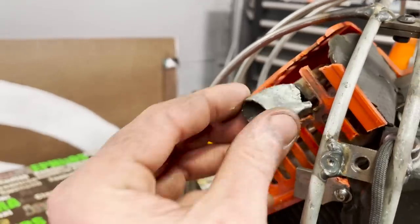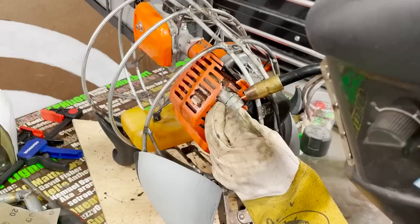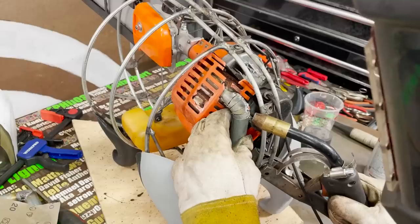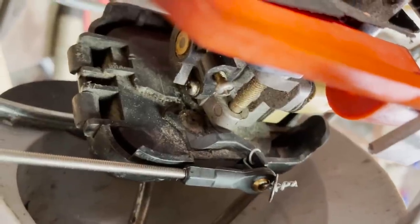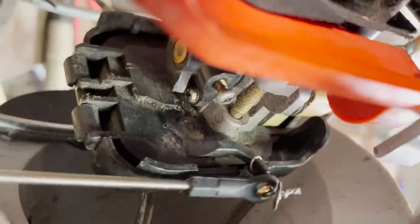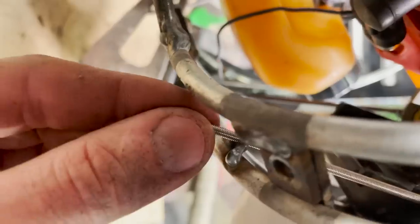With the engine in this position, the exhaust is basically going to melt a hole through what would be his left butt cheek. So I lobster backed a pipe together that reroutes the exhaust down to his belly and comes out hidden between his rear legs. There's no way that I could reach the choke on the carburetor, so I had to extend that also, and I used some safety wire, a heim joint, and threaded rod to extend it out of the bottom of him, hidden between his rear legs also.